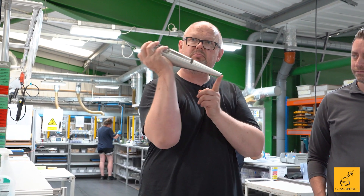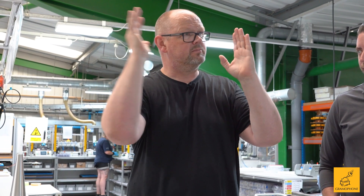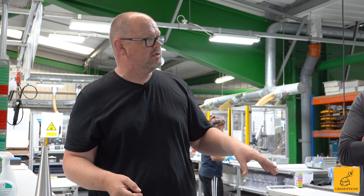The dome, when it's in position, is right here on the end of that, and the energy from the dome goes down that tube. So: back of the cabinet, front of the cabinet, drive unit. As the drive unit moves forward it makes sound; as it moves back it puts air pressure into the cabinet. The more it moves, the larger it is, the more the air pressure builds up. You get to the point where that air pressure starts to provide a compressed air space pushing back against the drive unit, influencing how it behaves. The solution from the Nautilus is you take the back of the cabinet and move it away from the back of the drive unit, and allow the energy from the back of the drive unit to dissipate down the tube length. The larger the cone, the longer the tube length — which is why a Nautilus has a tube this long at the bottom, because it's at the end of a big 12-inch. In meters, it's three and a half meters, which is pretty long.